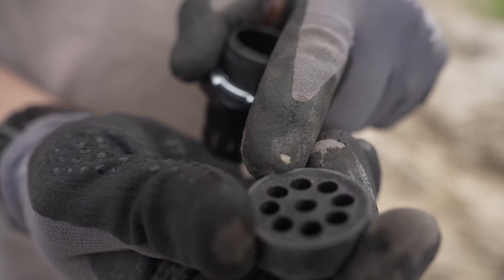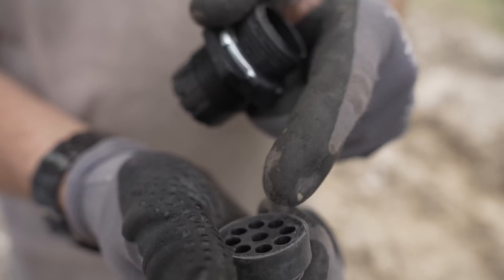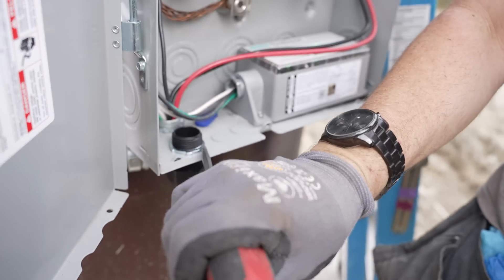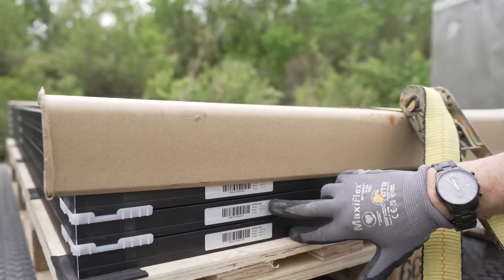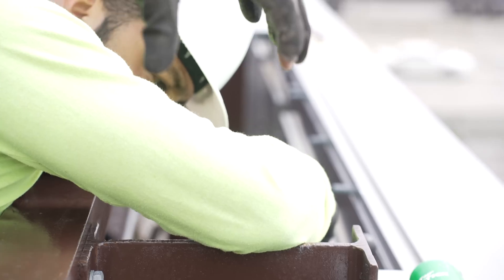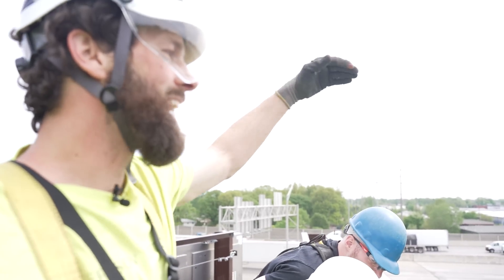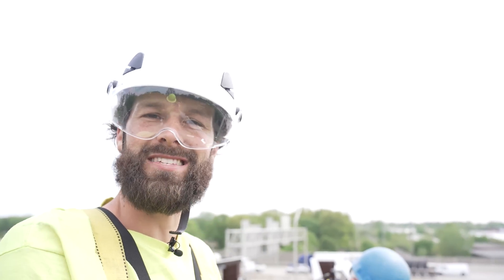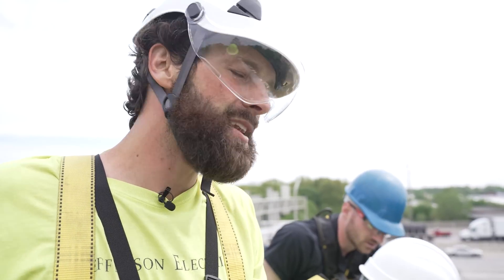The wire will come through here. Normally it's PV wire, but we're not doing PV wire because of micro-inverters instead of optimizers — it'll just go through with a watertight rubber fitting to keep moisture out. We are installing Evervolt panels, which are 410 watts apiece. There's going to be a vertical four-inch Schedule 40 mechanical pipe secured to this 10-inch I-beam in the vertical orientation, catching a cross member that shoots across the top — all four modules secure to that. It's an engineered solution with an engineered stamp on it.